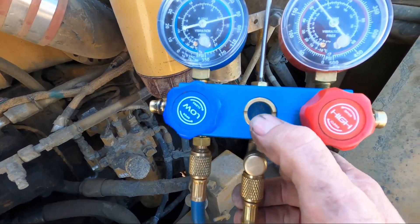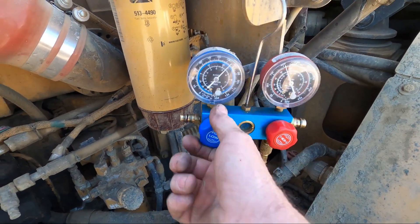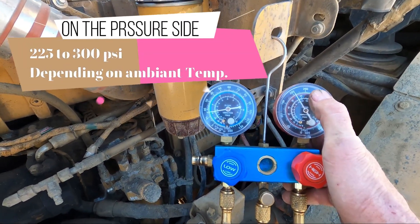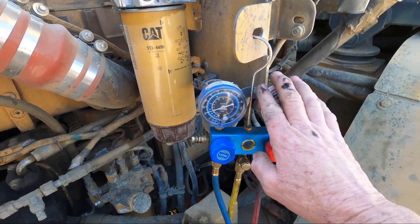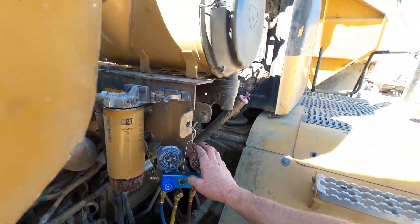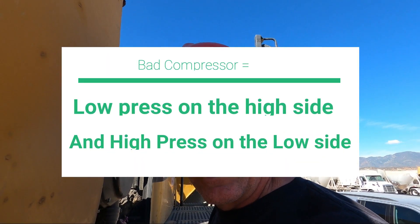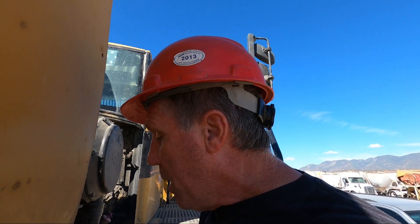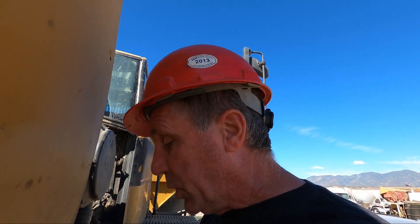As you can see when I'm charging you can see the liquid go through the sight glass. I don't pay too much attention to that - I really only pay attention to it to make sure the pump's working right and the dryer's not plugged. If the pump's not working right we're going to have a really low high pressure and high low pressure because it's just not compressing. But if the dryer's plugged it's the opposite - we build a really high high pressure and have low low pressure, because it's like a filter that's blocked. That's harmful to the compressor and the system just doesn't work right.